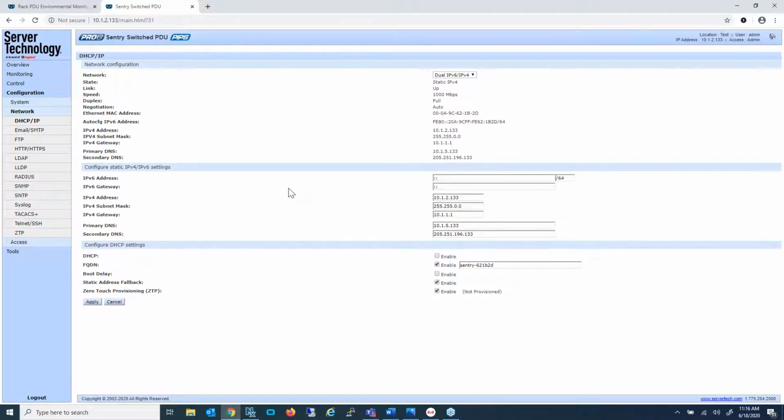So if I have a number of PDUs to configure, I could sit down at my desk and do all the configuration through this spreadsheet tool. This is initial configuration data only. It's what is intended to get it up and running on the network, as we just saw. And then I would take that startup stick and just go down the row in the data center facility. Now, it is initial configuration.